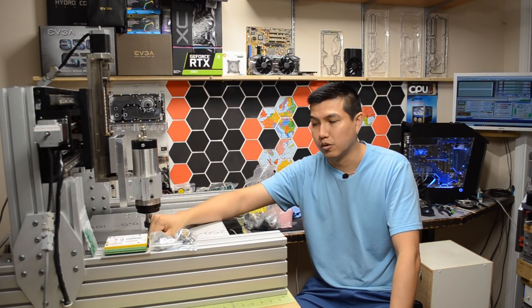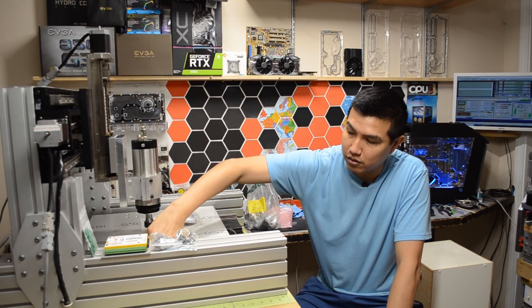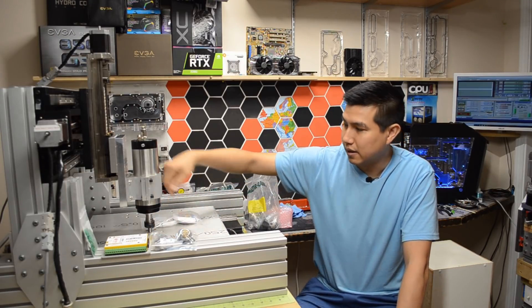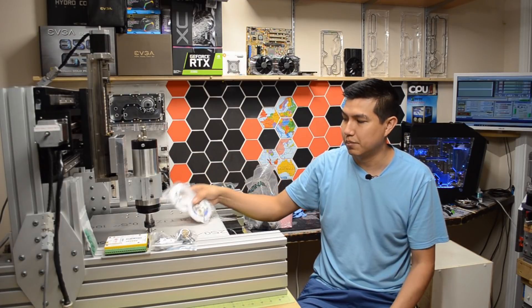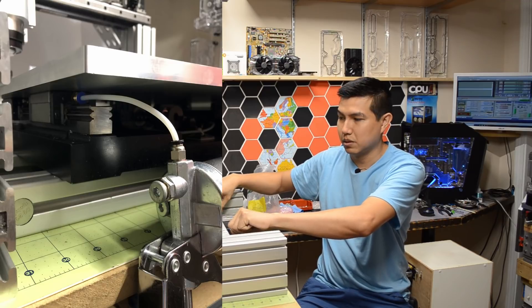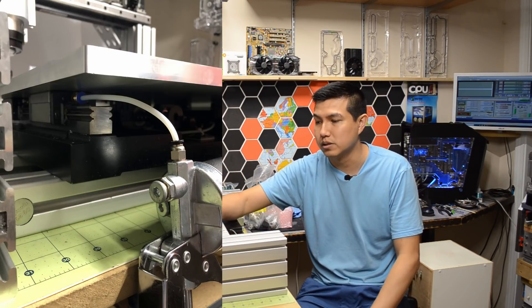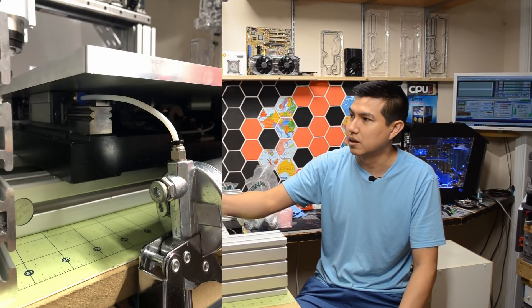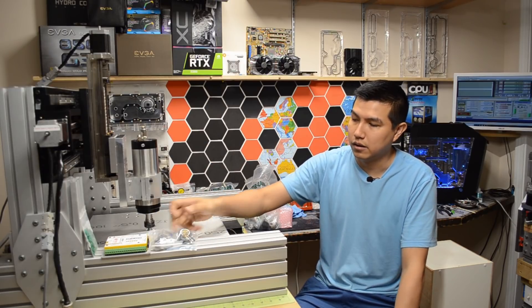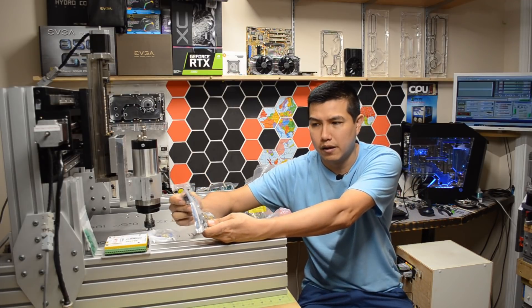First, I'm gonna have to put pneumatic fittings into the linear rail blocks in order to put some grease, because the fittings are on the side that I cannot get to. I'm going to extend some fittings maybe to the front and back of the table so I can get grease in there.